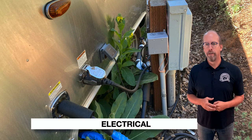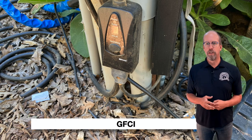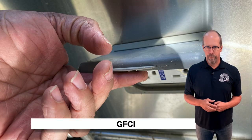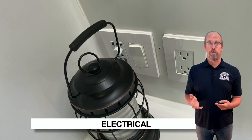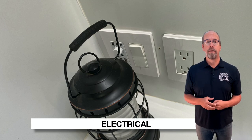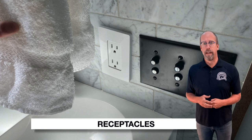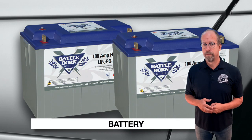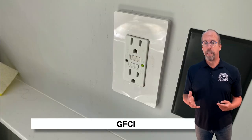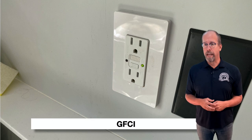Check the electrical connection to the trailer — look for potential hazards. Test the GFCI if installed. There's a GFCI receptacle and extension cord for wrapping the water lines to prevent freezing, and an outdoor GFCI-protected receptacle on the trailer. Check internet and TV cable connections. Receptacles are three-prong grounded 110-volt with USB charging ports. Check the receptacles with your receptacle device. Check the solar system on the roof — wiring, connections, and sealants on panel fasteners. Check the battery, its compartment, and connections. Test the GFCIs. Check the generator — its running hours, condition, wiring, connections, and starts. Turn the trailer lights on and off.